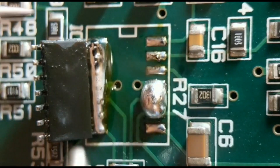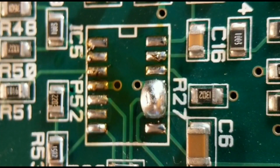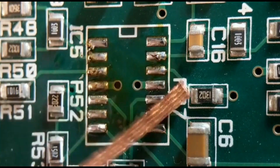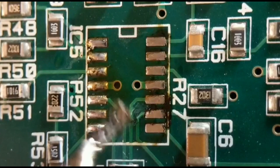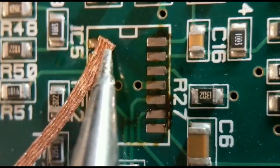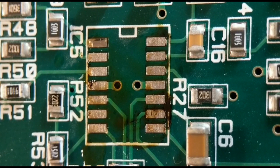Get your tweezers on the IC body, remelt the second side with the other iron, and just take the chip away. Afterwards go along with solder wick to remove excess solder. This is a really safe option for two-sided ICs, and a second iron is great for removing resistors, capacitors, and other two-sided components — I'll probably do a dedicated video on that. You end up with a lovely clean board with no damage. That's my preferred option out of the four. I hope there's something useful for all of you — thanks for watching, and please subscribe if you enjoyed it.